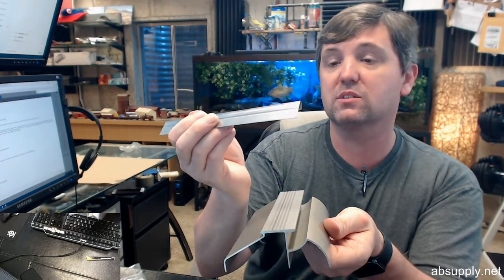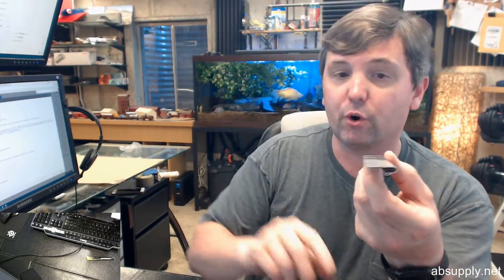That's no problem. I believe the part number is Z61 from Pemko for their zinc hook strip. Indeed it is. The zinc hook strip from Pemko, the current crop, is going to be flat up here and have a slightly wider scenario here. So you can easily order just a replacement hook strip, which is not uncommon. The door gets unhung and that hook can get damaged. Now back to the threshold.